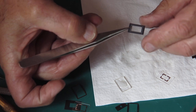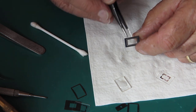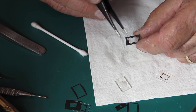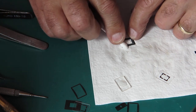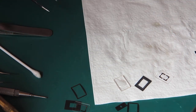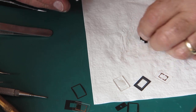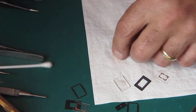I'm wiping these edges carefully because I can see there's lacquer still on those edges. Normally I clean these components with acetone to get rid of that lacquer. This celluloid piece at the front has a little blob of lacquer on the top and bottom where it was stuck in place. It's shiny on the inside and matte on the outside, and it's also got the frame markings and parallax markings. The top of this frame has two tiny marks either side, and the bottom only has one little mark in the corner.